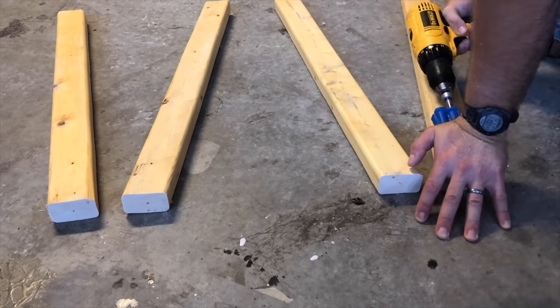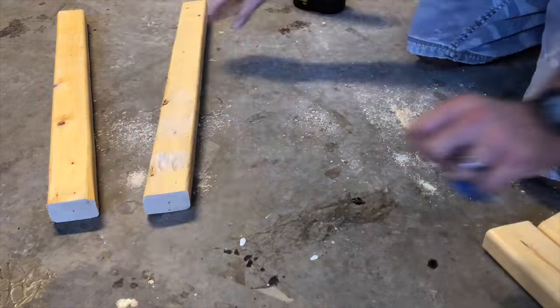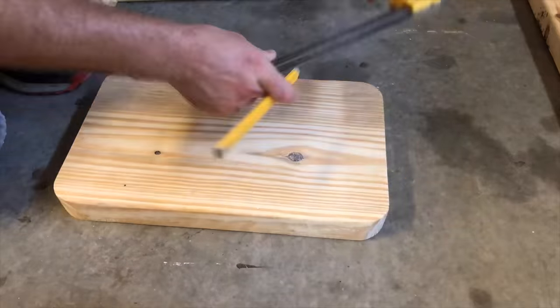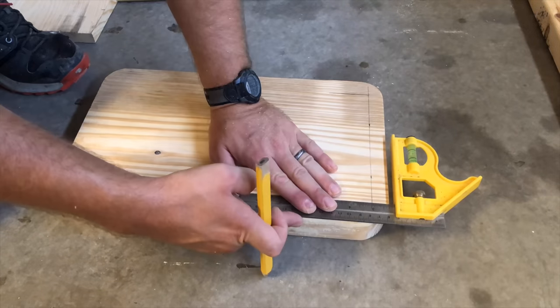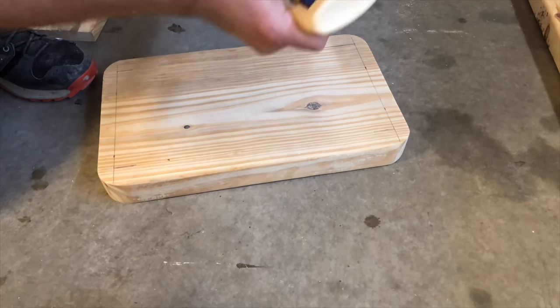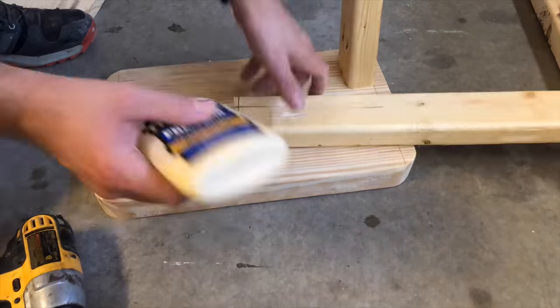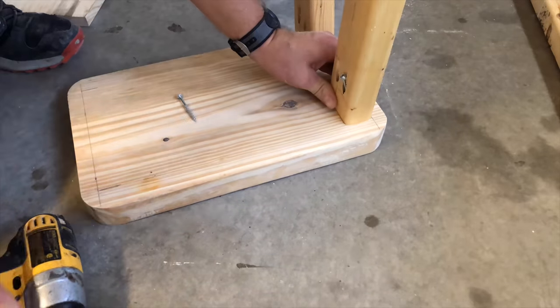This is what one of your four completed legs should look like. Lay your legs out how they're going to connect to the barstool, then drill two pocket holes on each one where they'll connect to the top. I'm marking three quarters of an inch from the short sides and one inch from the long sides of the seat. Once that's complete, I'm taking wood glue and pocket screws and joining the legs to the inside corners. Make sure the legs are angling outwards.